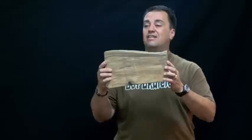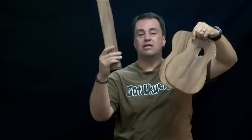We'll get a piece of koa like this and slice it — the initial slice is about 3/16 of an inch, very thin. We'll get the first piece off the block and the second piece, and those two will become a pair. They open up to reveal symmetrical grain, known as book matching. We'll get the first set and make that the top, the next set becomes the back, and the following set becomes the sides of the ukulele. We want it to be nice, uniform, and color matched so it's all from the same log.